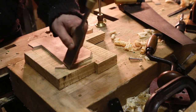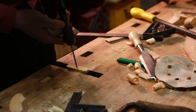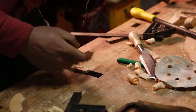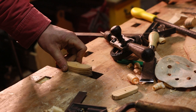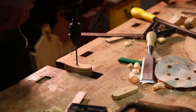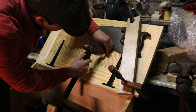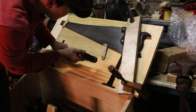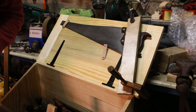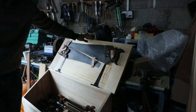This was probably the most satisfying part of the whole job — just placing a bit of leather on a piece of wood and then bringing a nice sharp chisel up to it and driving it right down through the leather. Once I had all the little pieces ready, I had to go about attaching them to the lid. I have a piece of pine here left over that I'm going to bore a quick hole down through, and we can attach that piece on top of the cutout we made — it'll fit inside the saw handle. Once we have it all ready we can drive a copper nail down between the two of them, and then go about tediously gluing that into place. I left this overnight so I came back the next morning and they were as tight as could be.